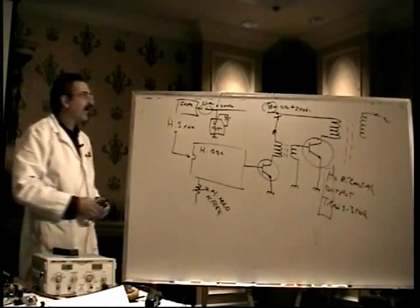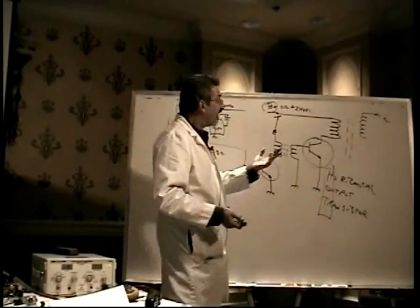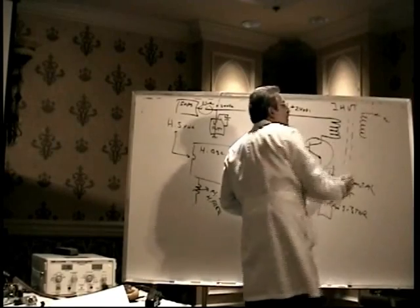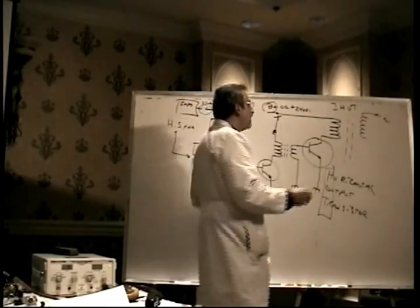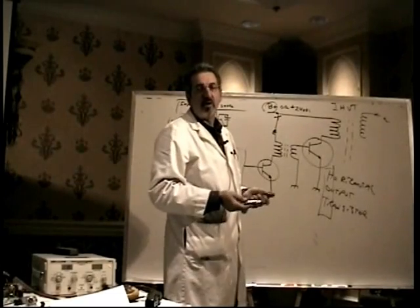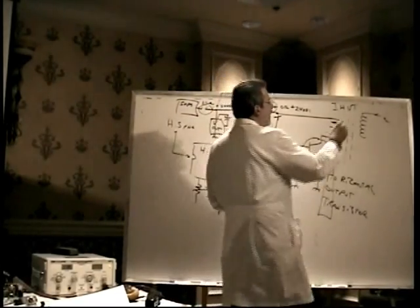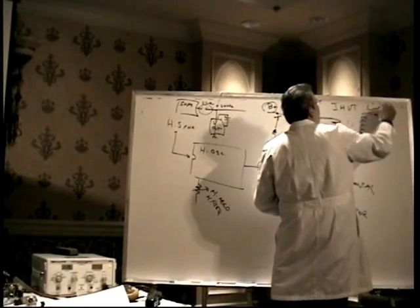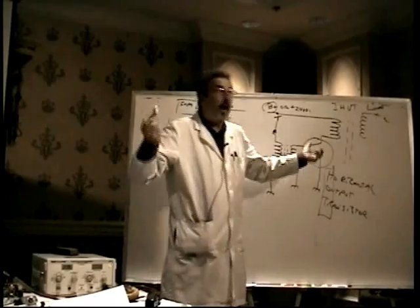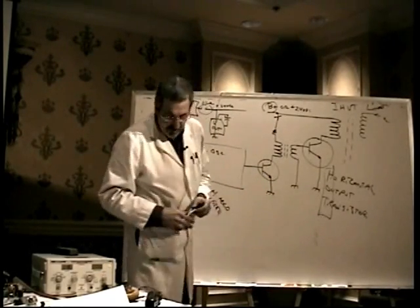It's a little more than a flyback transformer. It's got some potentiometers and some diodes in it. Technically, its real name is Integrated High Voltage Transformer here in the United States, IHVT. Nobody will know what you're talking about if you call it that. If you don't call it the flyback, no one will know what you're talking about. But its technical term is IHVT. In Europe, they call it the LOPT, L-O-P-T, line output transformer. What line they're talking about, I got no idea, Ray, but that's what they call it. So anyway, that's the flyback transformer.